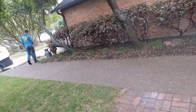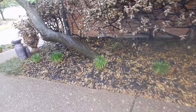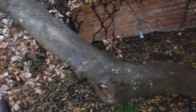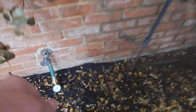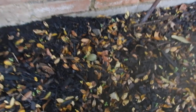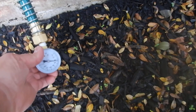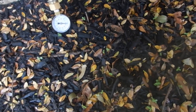There is a bib faucet right here by the front porch, but I'm going to the bib faucet on the east side of the garage — it's the closest one to the meter. We're looking for between 40 and 80 psi. Wiping it off — reading about 50 psi. 50 psi is good.